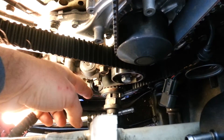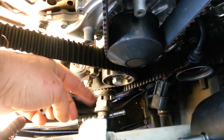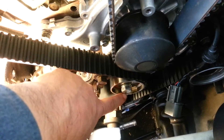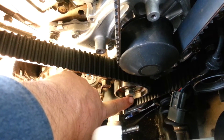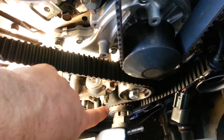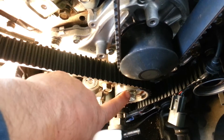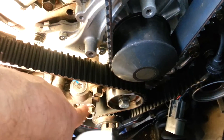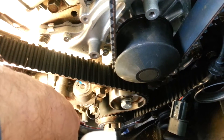I leave the pin in overnight. You'll notice how that spins freely — that way you know that you have the tension properly. I don't use a torque wrench; it's just too difficult. The pulley wants to move in both directions when you try to tighten up this bolt. In some instances you're pulling it counter-clockwise to fight the tension, and in other instances you're moving it clockwise to get the proper tension. Just make sure that once you get the proper tension and this pin moves the way you want it to, when you tighten this bolt you don't keep moving everything clockwise and making it tighter than it should be. It takes a little bit of touchy feely to get it right, but as long as this pin is moving freely you've got the right tension on it, and a torque wrench really isn't necessary.